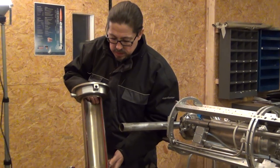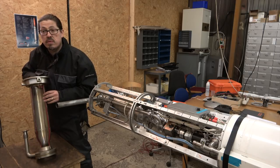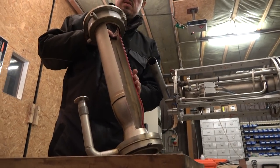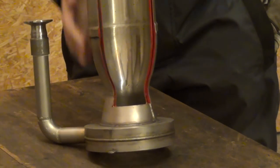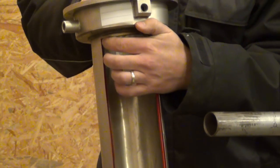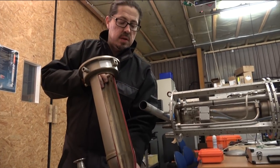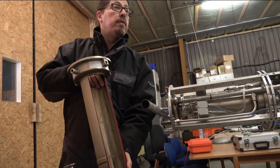I have taken this little piece of hardware so that I can show you how the engine works. If you have seen one of the last videos we did, I showed you on a big engine how a rocket engine works, and this is a cut-up of the BPM5 engine. You can see that this engine uses the same overall principle — the fuel is pumped in here into a manifold, then the fuel runs along the side of the engine down here and is pushed up into the part of the engine where we have the injector. The injector mixes the liquid oxygen and the fuel, it is pushed down into the engine and combusts, and then it comes out of the throat down here and produces the thrust of the engine.